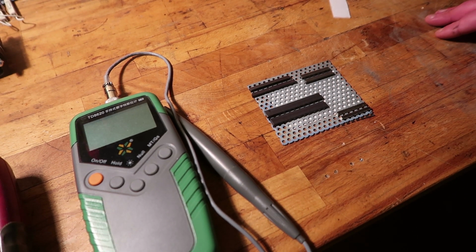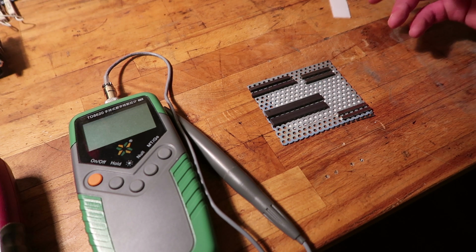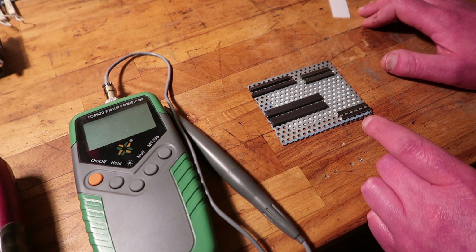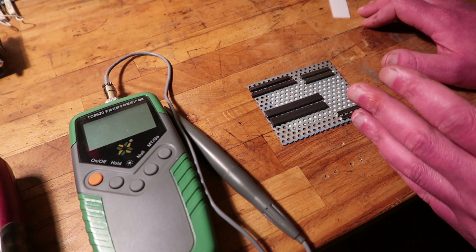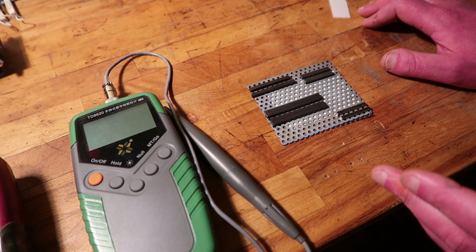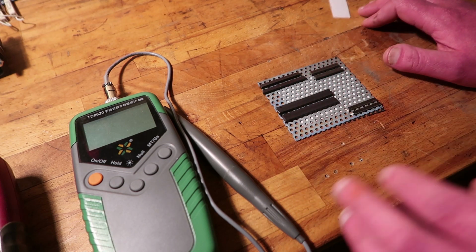The factory said, we make it and check if we can indeed magnetize it as you want it and how well it works. Because we were not sure. And they said, what are you expecting? What are you looking for? I said, well, I'm looking for at least twice the amount of surface Gauss than my current magnet. I prefer a little bit higher. So they said, well, you can then use a little less powerful rubber magnet, which is cheaper, neodymium rubber magnet. And I think it will suit your purpose.